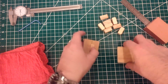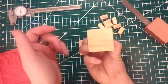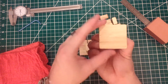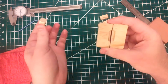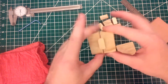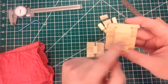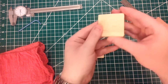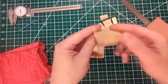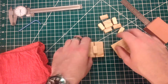And I made up a few of these. Here's one of the blanks. The way that I milled these out is I just mount this in my vise. It'll grip it like this, and then I index off of here and here. Put my center right here, and then I milled out my relief, which in this case was this little oval looking thing. That's going to help us keep everything in the same spot over all of these pieces for both sides, because the vise will be the same here, and this is on the end. It'll butt up against the vise jaws this way, so everything should be as close as we can possibly get it to the same on all of these. I haven't actually run any of these yet, so I guess we'll just see how well it turns out.